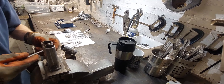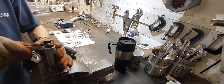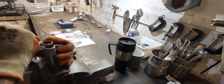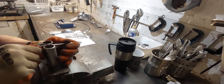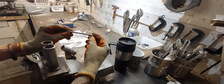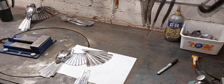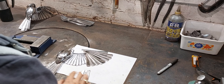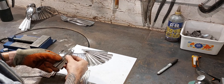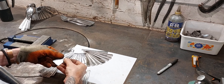A little jig here for bending feathers — just two pipes welded onto a bit of a flat plate. Really gently ease this along for a nice little curve. Starting to put the wings together, I'm going to start with the inner wings. These are all cut to the right length — I'm just going to tack weld them in place, and they're not going flush, they're going to overlap very slightly like that.